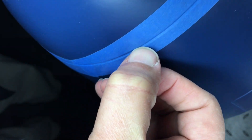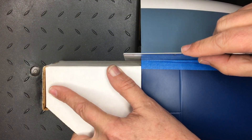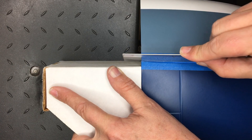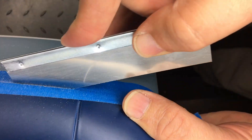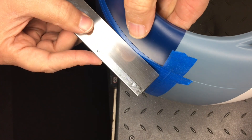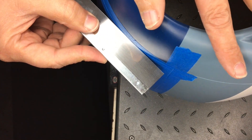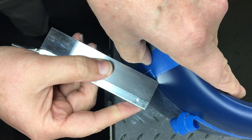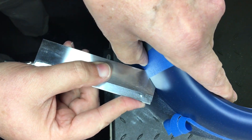The Top Flight Hellcat comes with a one-piece fiberglass cowling. Before cutting out the cowl flaps and the access panel, I'll lay down a piece of masking tape to help protect the finish. I then use an X-Acto saw blade to carefully follow along the panel lines. Just be careful approaching the edges and you should get a nice clean finish when you're done.